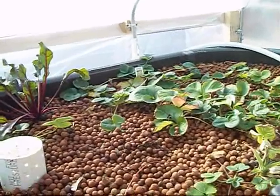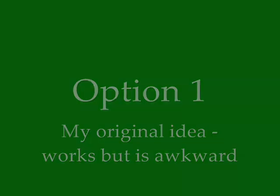What I want to show you next is how I enclosed the greenhouse. On this end, you're seeing the inside of what I did. I created a barn type of shape out of 2x3, and then I just used one-hole connectors to connect the EMT to that with the plastic. You can do that, but it's kind of awkward — you'll just keep going around the perimeter like that.